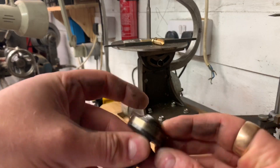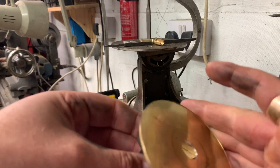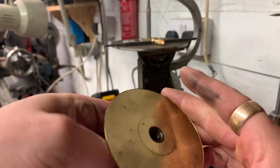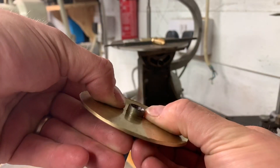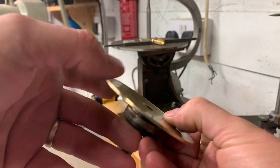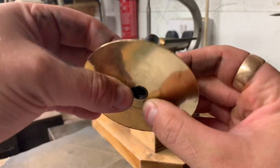This is a spring arbor for slitting saws, and like I say this doesn't need to be accurate. I'm really lucky that the center is bang on half inch, so we're going to lock this down and then turn it to three inches on the lathe.